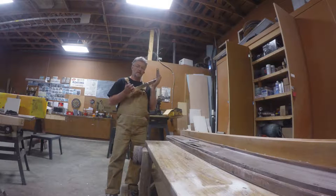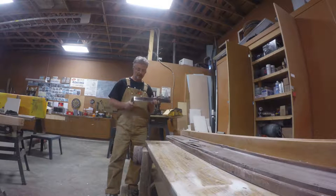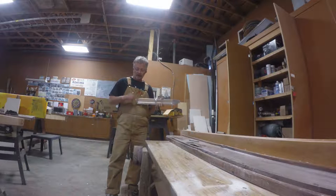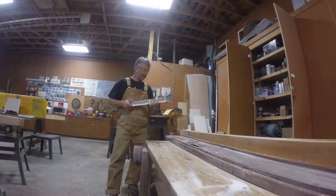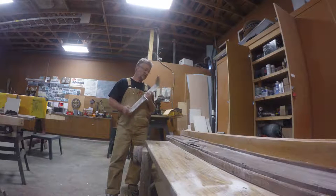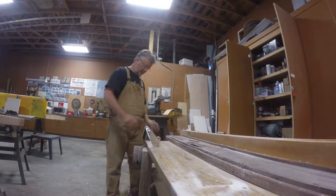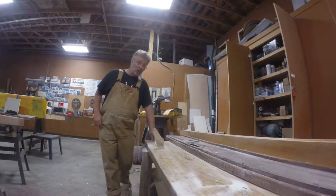So brand new, this is a $275 piece. I'm hoping to be able to have it remanufactured for less than that, but it obviously needs to be remanufactured because it's got corrosion. These pieces here are 3/16. I'm probably going to have them upgraded to 1/4, and it's in 304 stainless. I'll probably have that upgraded to 316. 316 has more chrome in the metal, so it's more corrosion resistant. The downside of 316 is it's not as strong.